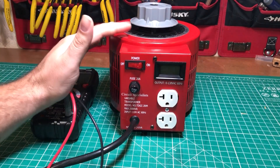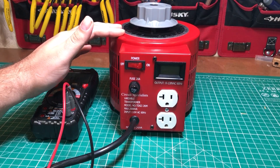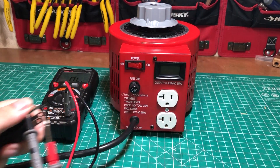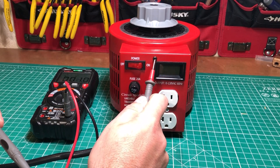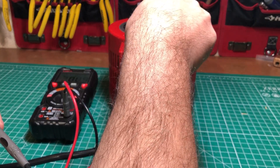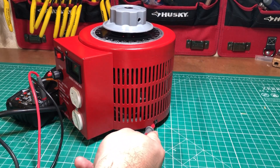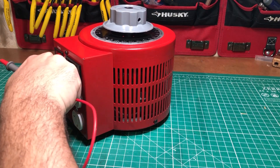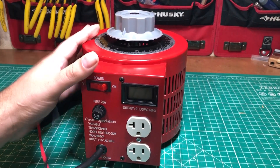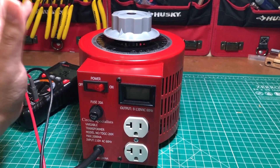The first thing we want to know is: is this device grounded? These devices are mass produced, so we want to make sure that there's an actual connection between the ground on the plug and the chassis. We're going to start touching screws — we are grounded there, grounded here, grounded at the top. That basically covers it; we are grounded in the different places that we need to be. We want to make sure that if there's ever a fault, the electricity has a path to ground.